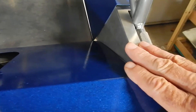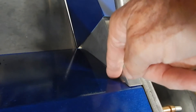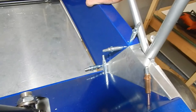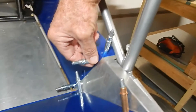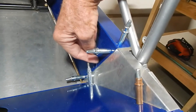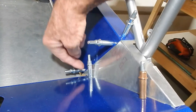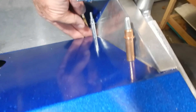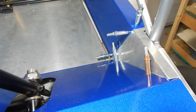I need to prime and paint this, get the holes match-drilled, and drill holes along here to set the pieces together. This piece goes around the cage frame — two rivets up top, a string of rivets along here. I left a gap where my cables are behind so I don't have rivet heads rubbing against cable. These use a larger Avex rivet down here. I have it flush and locked in. Apparently the whole piece can come out as one unit even with the boot on — it will slide up and the whole piece can be removed.